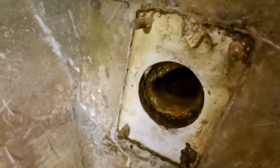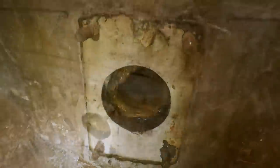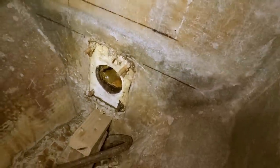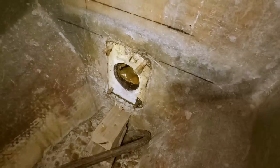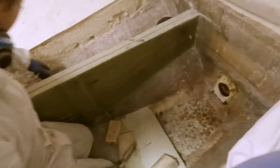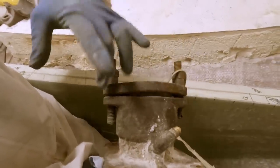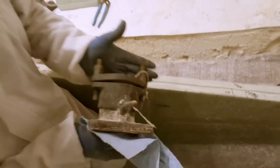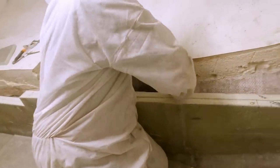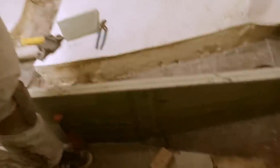Not safe for work warning - a little layer of grease. I'll have to tape some cardboard to that wall or something and scoop that stuff out of there - try not to make a giant mess. It would be nice to upgrade. You can see how much this flange is distorted right there - that's from over-tightening it. They probably ran out of packing or something and didn't have the correct amount, so they were torquing down on it to keep it from leaking, damaging it in the process. Those are actually pretty expensive to replace. So now that that's out, we'll get these studs out of the way, double nut them and see if we can pull those out and see exactly what is holding them in.